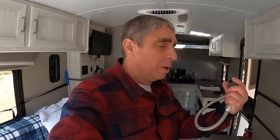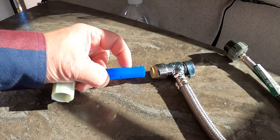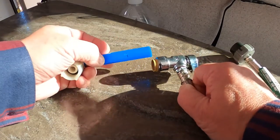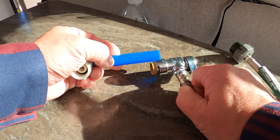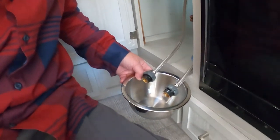I used all of the slack afforded to me when I removed that extra panel, so it really took a lot to get in there and use the tool appropriately. The instructions illustrate there's a specific depth you need to insert this fitting, and essentially you just push it in and it's connected — there's a little sleeve you can put in after the fact. I have the connections pressed onto the PEX tubing and used my cereal bowl to purge the air out. They're connected, the valves are in the closed position, the system is pressurized with the pump on, and they're dry as can be — I can feel the warmth on the hot side.